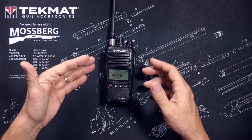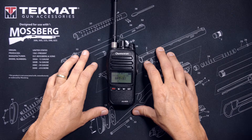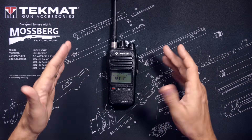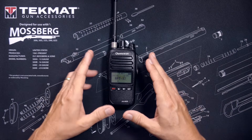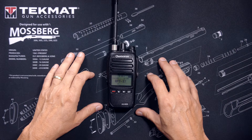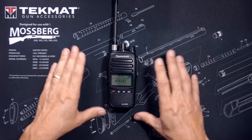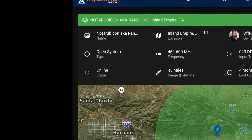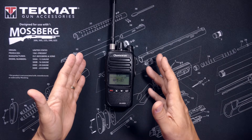So if you hear that kerchunk sound or the repeater's roger beep, you know that you are hitting the repeater and are able to use it. Optionally, you can call out on your radio and ask for a radio check — that means asking for somebody to respond to let you know they can hear you. However, some repeaters sit silent for days at a time and there may not be anyone listening to answer you. But if you are hearing that repeater return sound, then you know that you are hitting the repeater. Finally, virtually all GMRS repeaters are privately owned, usually by someone who used their own hard-earned money and time to set that repeater up, and they may require permission before you can use it. If the repeater is listed as open on the My GMRS listing, then generally no permission is required.